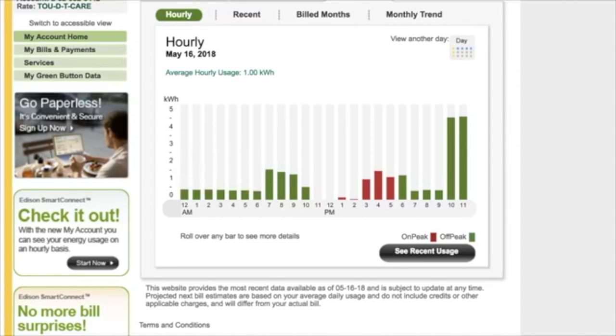Here's our house at midnight using about 540 watts — so roughly half a kilowatt overnight. That's what's on: probably the refrigerator, a fan, maybe some lights left on, and this computer here that's now pulling from the main system. That's usually how much my house pulls — about 500 watts. Then around 7 a.m. somebody gets up and it jumps to about 1.59 kilowatts — three times more.